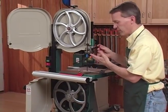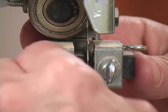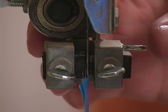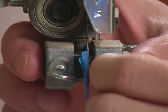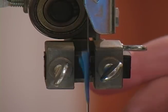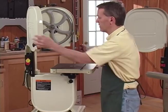Adjusting bearings with an Allen key can be a little bit tedious. Other saws have guide blocks on them — I find these much easier to adjust. Here you simply loosen a thumb screw so that the blocks move freely, then position the tape in between them and give them a gentle squeeze so the blocks are up against the tape. Tighten the thumb screws, then check that the tape moves in between the blocks. That's all the time that takes — a very nice little system.